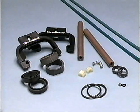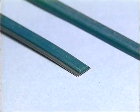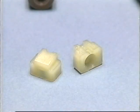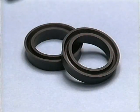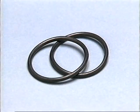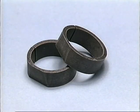Repair kits for cylinder sizes 1 through 2 1/2 inches include an inside sealing band, an outside dust band, 2 end caps, band inserts, springs, bearing rods, U-cups, and cushion seals for the piston assembly, O-rings for the cylinder head assemblies, O-rings for the cushion needle valves, and wear rings for cylinders with bore sizes of 1 1/4 inch and larger.